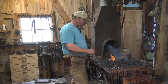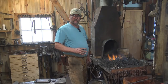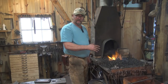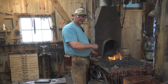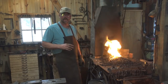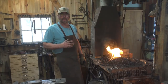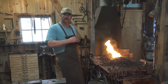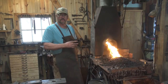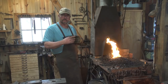So we're going to get a coal fire going here. Most gas forges barely get up hot enough to weld mild steel, especially at our altitude — we're at 6,500 feet — so I'm not even going to try and weld wrought iron in the gas forge. We're going to do it in the coal forge. I know this will get hot enough; I've done it before. The bloom has to be drawn out into some sort of a bar.